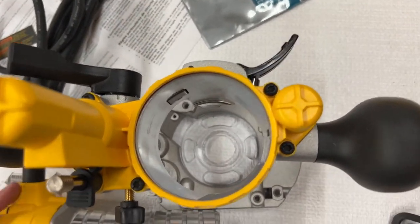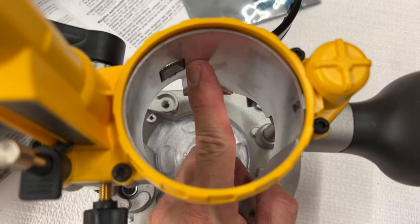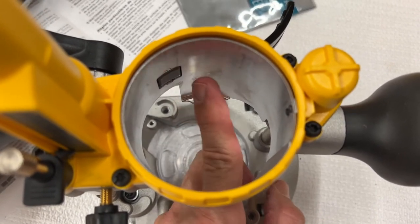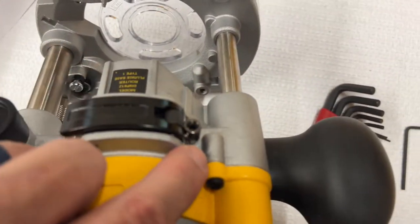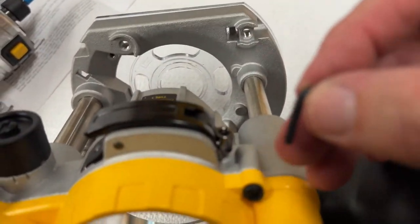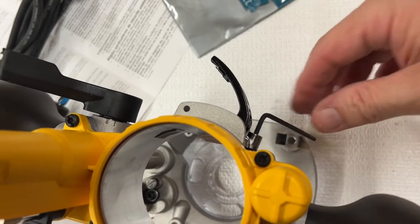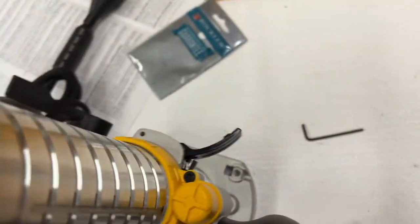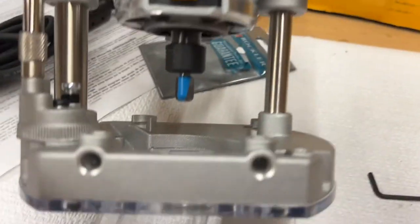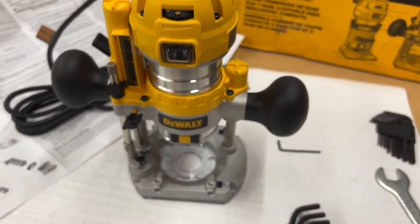So obviously it's got to be loose. And then basically you just take your motor, line up the divots, and drop it down. The problem I had was right here — that's where the motor stop is. But my motor was stopping right here at this unit, and it didn't matter what I did, I couldn't get it through there. I ended up calling support, but they were looking it up and watching YouTube videos. I started looking around and playing with it, and basically I used a two-aught Allen wrench and put it in here and basically started cranking it in this direction — down, down, down. And basically it brought this unit further and further that way, and when that happened it got loose enough and now the unit slides right in, right down to the stop where I need to be. That's how it should look. And that was in none of the instructions anywhere that I could find. So just giving you a heads up — you might need to make that adjustment out of the box.